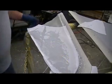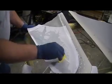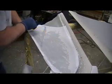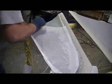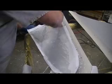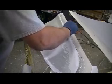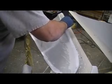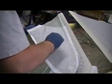This is my peel ply — it's like a nylon stuff that resin will not stick to. It's called peel ply, and if you just need a small amount you can go to a fabric store. It's called rip stop, and that's actually what this is, because I ran out when I was doing my piece. If you catch this stuff on sale, you can get it cheaper than ordering it. When I bought this it was buy one yard get one free.